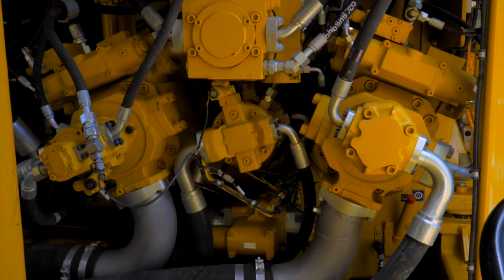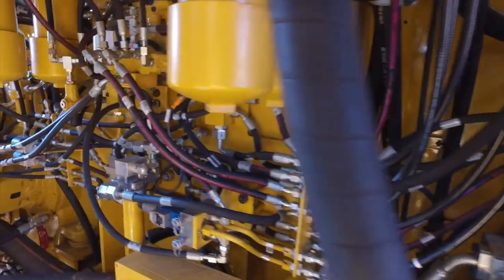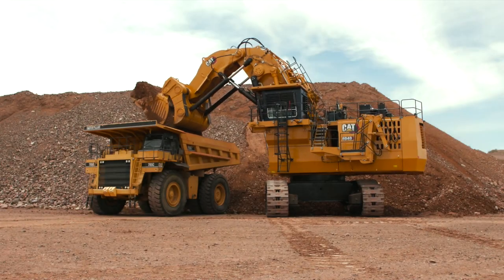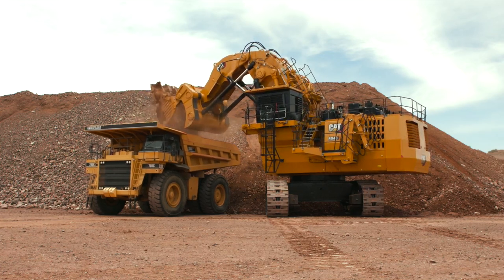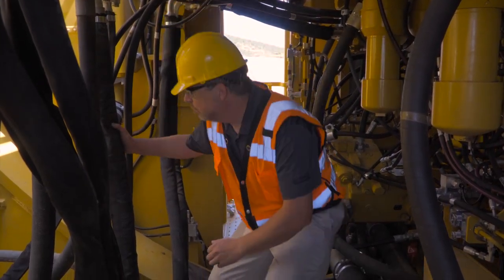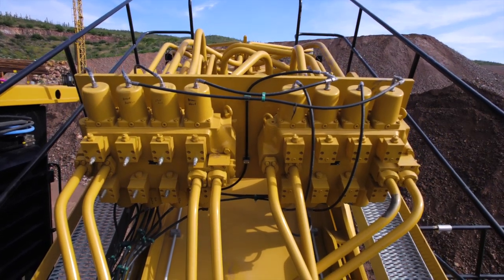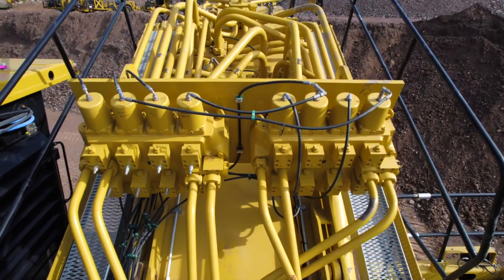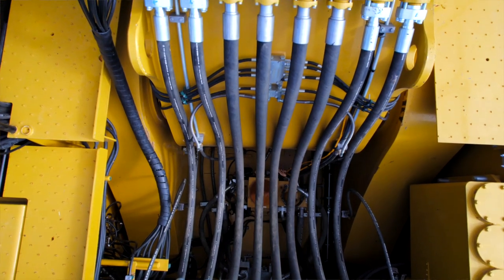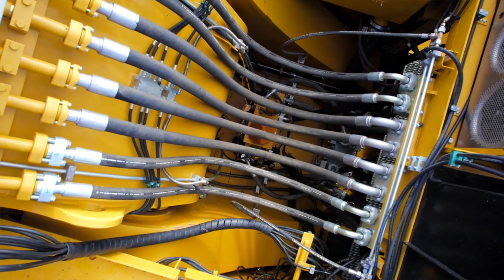These are the hydraulic pumps, which are governed by our intelligent pump management system. This system continuously evaluates actual engine and hydraulic operating values against set values and adjusts pump output accordingly. This results in greater productivity, less energy and fuel consumption, and reduced component wear. Going back towards the cab riser on the right-hand side, we have three swing drives and the rotor in the center, which sends oil to the undercarriage components. The main hydraulic valve block is located on the top of the boom. By having the main valve block in this location, we have less hydraulic lines routing from the superstructure to the cylinders of the front attachment. By reducing the number of hoses leading to the superstructure, and because we divide the flow only at the main valve block, we have fewer hydraulic hoses within this transition point.